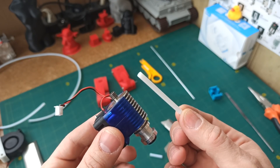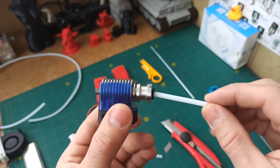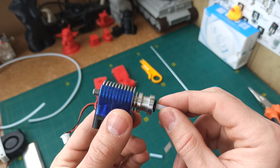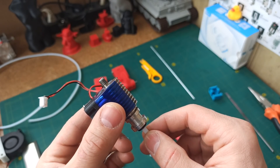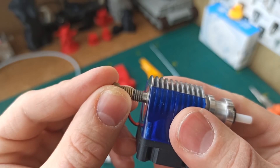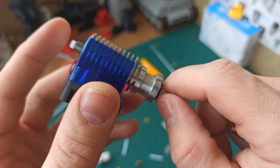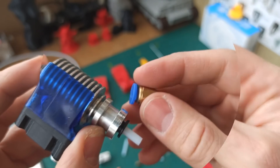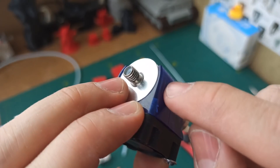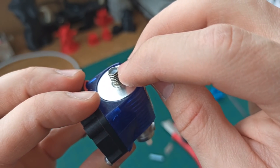Now we return to assembling our hot-end. We've cut the teflon tube very straight and correctly, and clogging problems should no longer occur. Insert the teflon tube until it exits beyond the thermobarrier. Here is a very important moment: understand that our fitting can move forward and backward. Taking this into account, pull the teflon back and leave literally 0.2–0.3mm of reserve so that the teflon tube sticks out slightly — the nozzle when screwed in will fully press it down. If you have a metal fitting, there are teeth inside that must grip well. If you don't pull the teflon back and don't leave this reserve, during printing the teflon will shift slightly upward as it grips deeper into the teeth — and a gap will form between the nozzle and the teflon inside the thermobarrier. Filament will pack into that gap and obstruct itself — that's what a clog is.